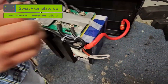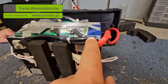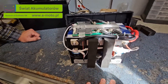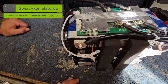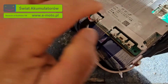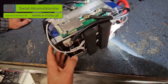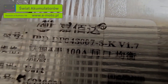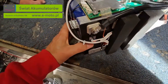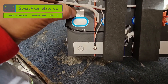These are protective sponges for the spacers. Inside, we have four cells — one, two, three, four. You have already seen the capacity of the cells. Connected in series, they have 100Ah in each of the ten tests. The BMS has parameters supporting up to four cells — it is a 100A BMS. Here is the number four marking — a four-cell setup, 100A. Overall, there wouldn't be anything particularly interesting about these cells. All the cells look identical. In a moment, we will check what the QR codes suggest.